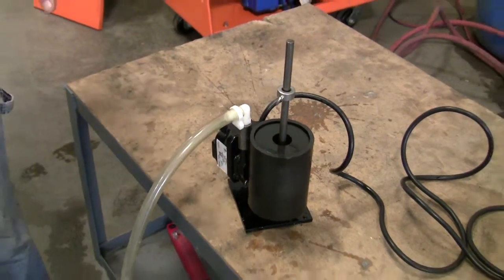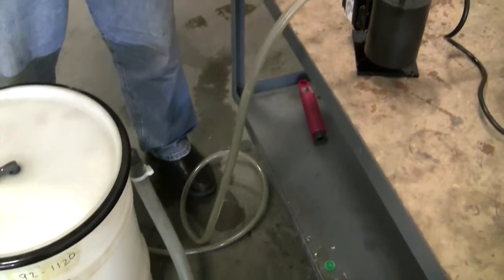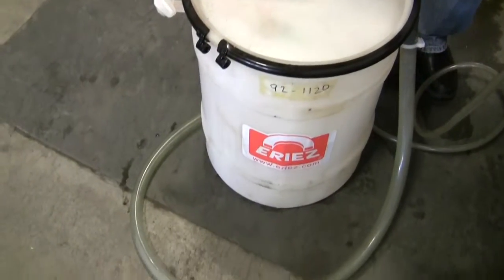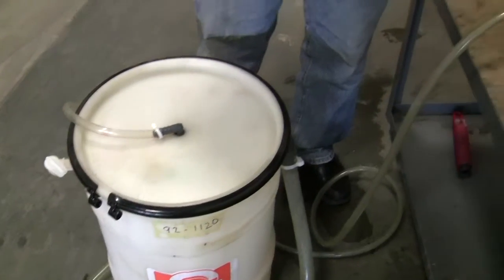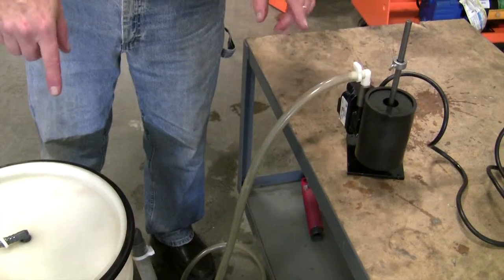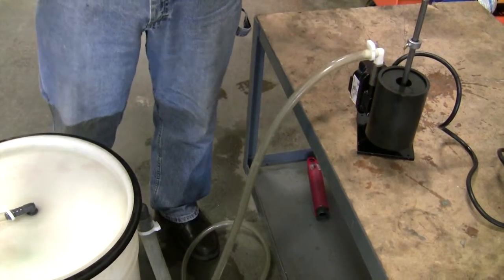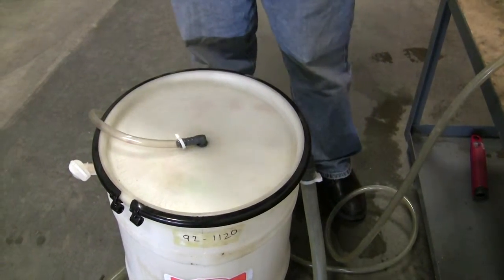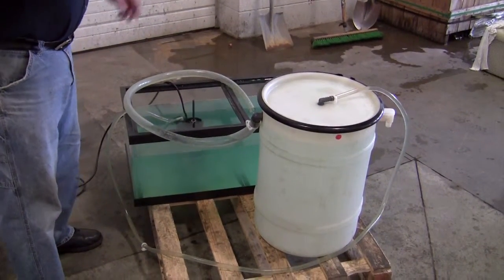Never shorten the hose, even though it may be way longer than you need, because shortening the hose actually allows the pump to work better but doesn't let the skimmer float like it needs to. Once you assemble these pieces, put the skimmer assembly into the sump, make sure the discharge hose is set up, and then fill the drum with new clean fluid because it holds 15 gallons and you don't want to suck all the coolant out of your machine tool. To turn it on and off, you simply plug it in or unplug it — there's no switch.